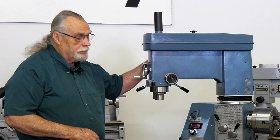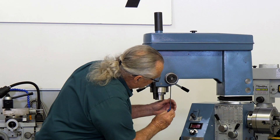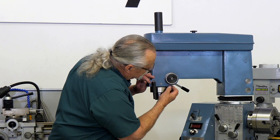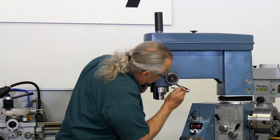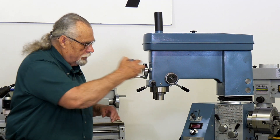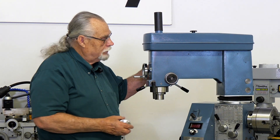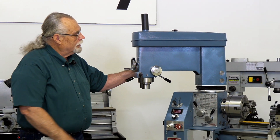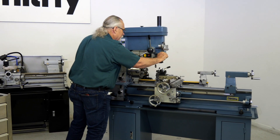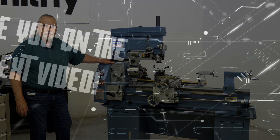Okay, now we've got more tension on that. Make sure that set screw is tight. If you need more tension, go put another detent on there. If that tension's fine, tighten the set screw. Tighten the lock nut. And put the cover on. If you ever lose tension completely, you just turn it a little bit at a time — one detent to the next — until you get the tension that you like. And the cap just slides back on just like that. That's how you adjust the tension and get that milling feed working nice and smooth. Hope this has been informative, and we'll see you next time. This is Dave, saying so long for now. Thank you.